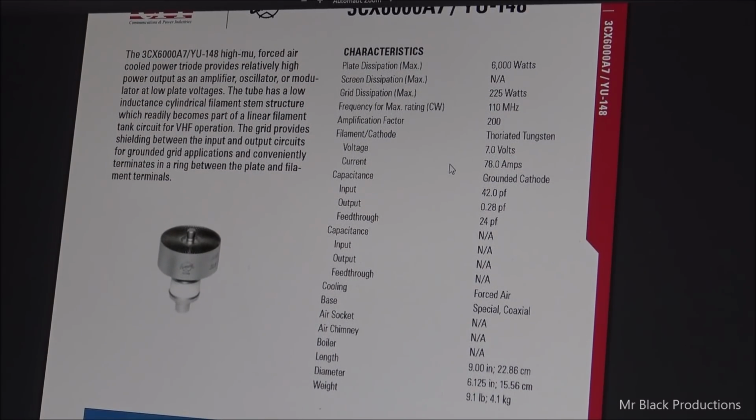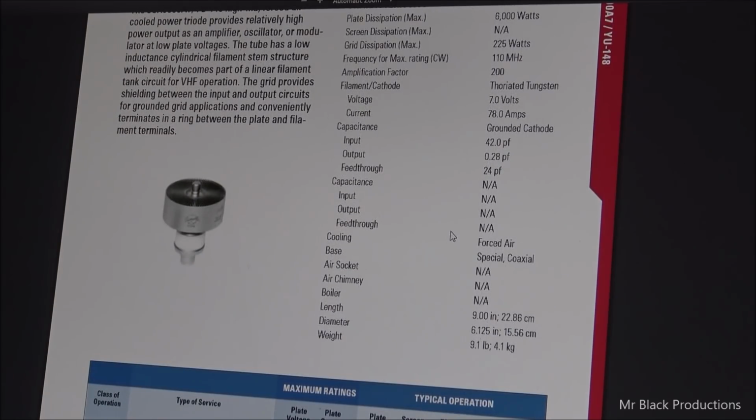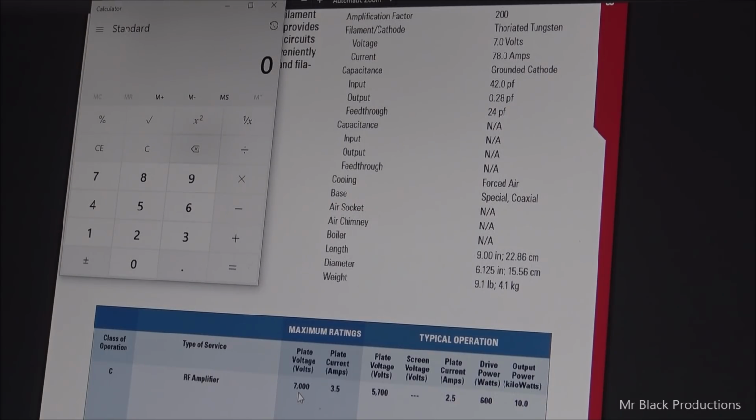But when we go and pull the data sheet, the full-blown, this is an amended data sheet. When you go pull the full-blown data sheet, you'll see that the input emulated load is exactly the same and the output emulated load is exactly the same between the 3 and the 6. So we're going to, once again, pull up, and I'll say 8,000 volts. We're going to divide that by 1.41 once again. And so we're going to get our top tap at 5,600 volts, roughly. And I'm going to show you how to cheat this here in a second. And we're going to spec that also for 3.5 amps on the top tap. Okay.